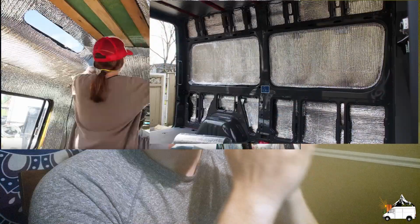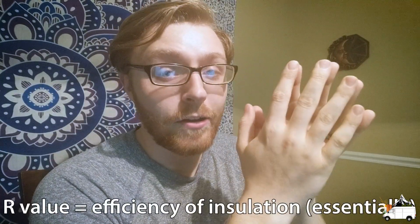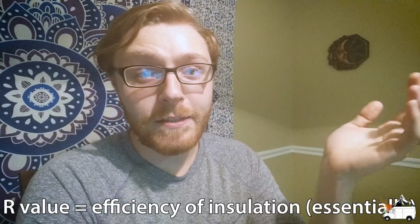All the insulations I talk about in this video are well fitted for a van. They don't absorb water, they provide a decent R value, and they're the most common you'll see used. We're going to start with the lowest R value per inch insulation that I have on my list, and that is reflectix. If you've watched van build videos, I'm sure you have seen someone insulate their entire van with just reflectix. Please, please, please do not do this. I mean, you can. It's just reflectix does not provide a good R value, and you're basically just wasting money.